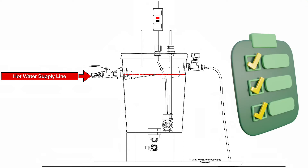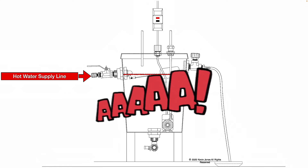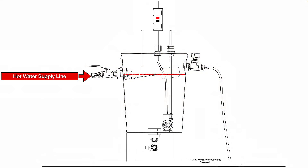A few things to note. From working on whole house humidifiers, folks that hook up a hot water supply line to their humidifiers will see a greater amount of calcium and mineral buildup on their humidifier filter pad. It may even clog up the solenoid valve that supplies water to the humidifier. So I strongly recommend, whether you use hot water or even cold water, make sure you install an in-line water conditioning filter. That'll help capture a lot of those impurities in the water so you have softer water being fed to your humidifier.